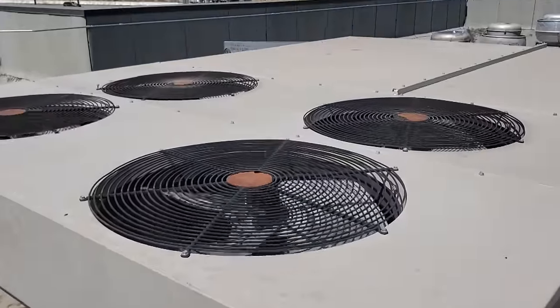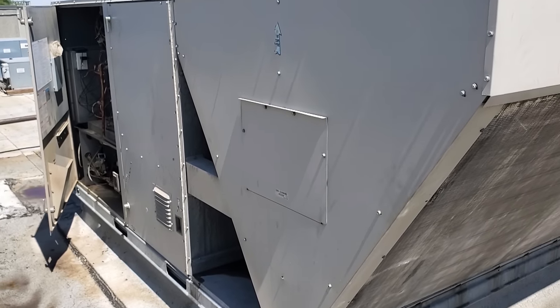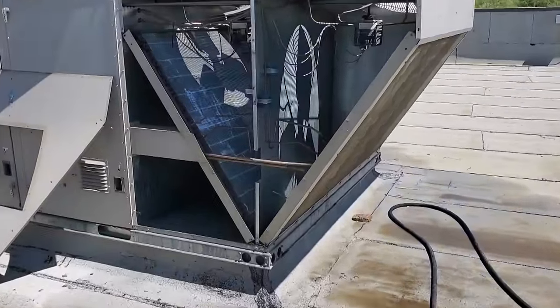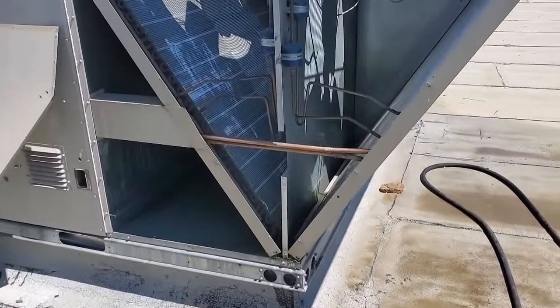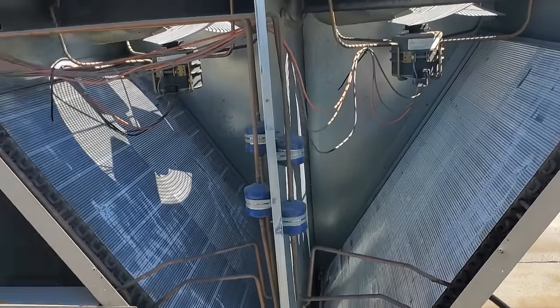All the condenser fan motors are running now. I'm gonna let it run for about an hour or two while I clean the other condensers, and then we'll go through. I'm just getting started on cleaning this one right now. These ones are not nearly as bad. The kitchens are always the worst. So this one will just take the regular condenser coil cleaner and the yellow venom pack real quick, give it a rinse.